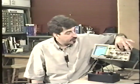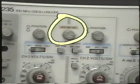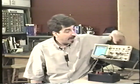When I flip this to the A alternate B position, I end up with the two sweeps. And this particular oscilloscope has another control called A and B sweep separation that I can use to separate the two. The position control moves them both up and down. The separation control moves the two apart. The sweep on the top is my normal A sweep. This is your normal sweep, and it's a sweep that you use for 99.9% of all the work that you do on the oscilloscope. When I flip it to A alternate B, it kicks in the B sweep.